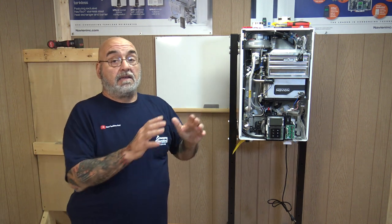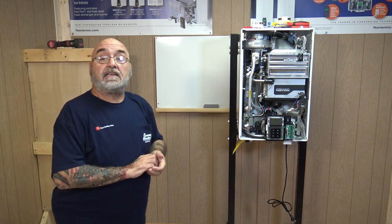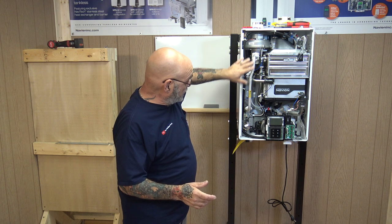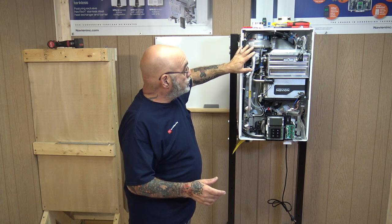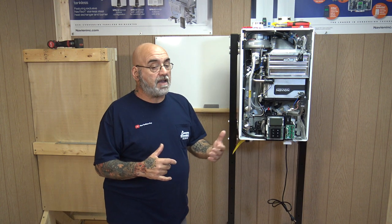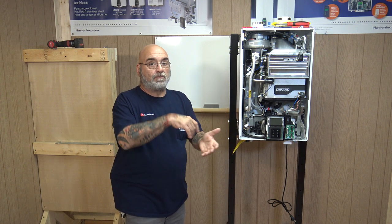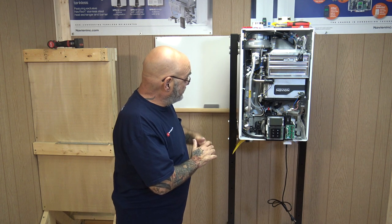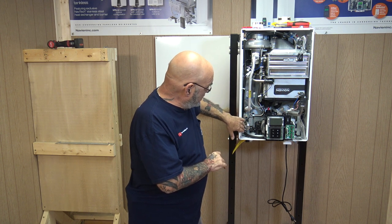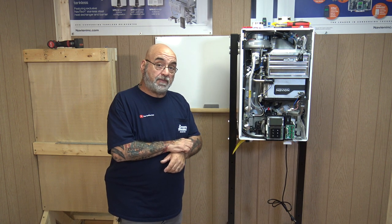So that's basically the conversion. You have six screws total, two screws behind the orifice. Do it in the mounted position so gravity works in your favor — put a tarp on the floor, not cardboard. Flip your DIP switch, put your markings on the heat exchanger with the date, put everything back in the bags, and you're done. Then on the setup wizard, set it up and tell it what gas type it is.